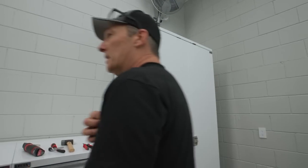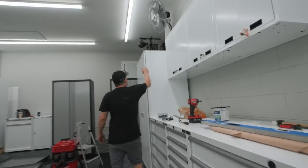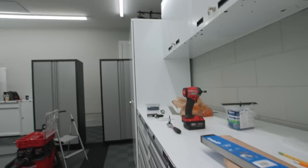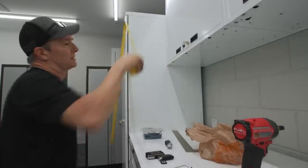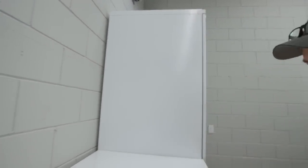What I have to do is duplicate what we have from top of closet to here, so that way when the uprights come together they'll look the same at the top. We have our level line already - it's 45 and 9 sixteenths, and we're at 42 and 3 eighths. So we're definitely going to have to shim it.